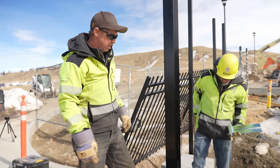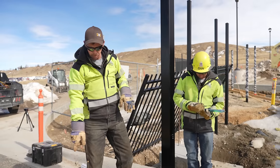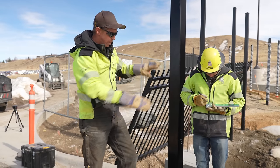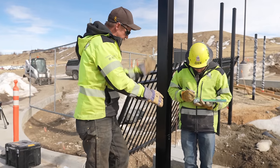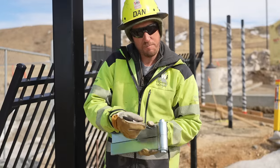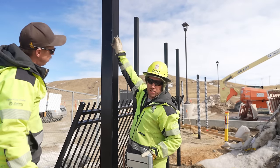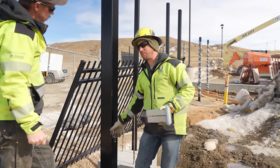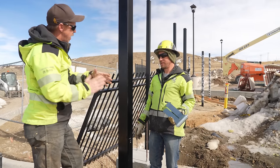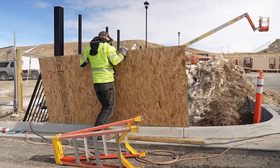We did a little head scratching and decided that maybe the easiest way to find the angle was with a square sheet of OSB. We're going to stand this up and level a straight edge. At the top our straight edge is touching the plywood; at the bottom we're going to have a gap. That's going to tell us how far out our bottom hinge needs to be on our post. I'm marking the center of that hinge plane so we can make sure both planes match up - because if they don't, we're going to get binding and it's not going to open.